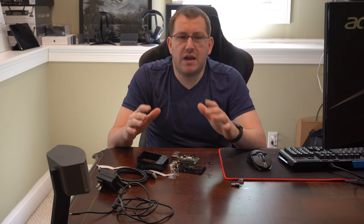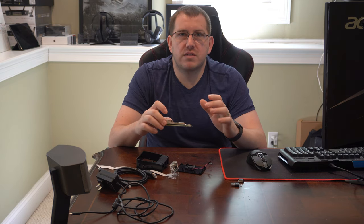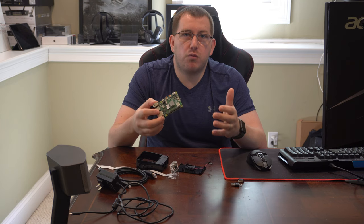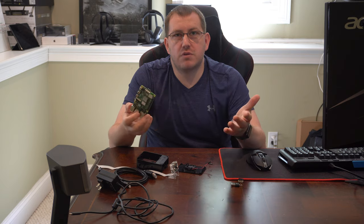Let's move on to the next use case, which is a little bit different. I haven't actually done this yet myself — it's on my backlog and I'll probably be doing a video on it soon. It's using Klipper to basically add the Raspberry Pi as a compute unit to your printer. It would offload all of the processing from your 3D printer's board onto the Pi, and the actual board on the 3D printer will just be responsible for the hardware. Theoretically it allows the printer to print faster, but I want to run more tests before confirming that — documentation and real world examples aren't always the same.